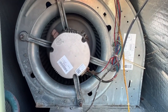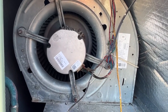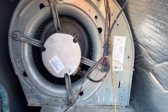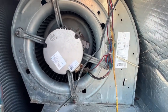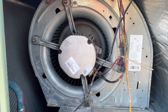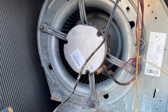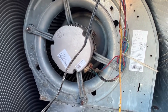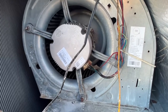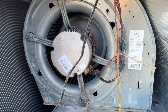So it's trying to come on here. Got a signal for the fan to come on. This is one of those X13 motors — 460 volt, one horse. Double check for signal, but most likely it's just a bad module. Have to change that out.